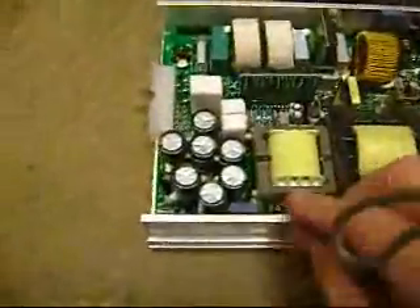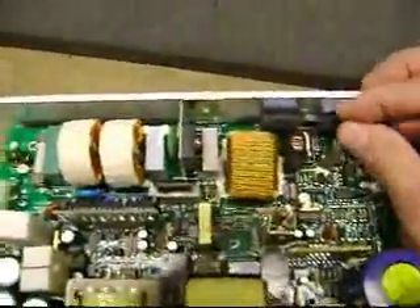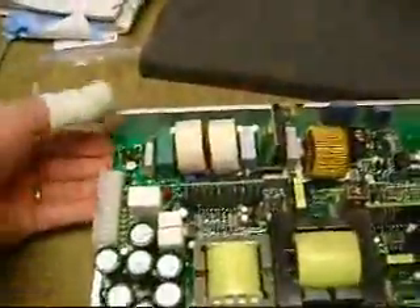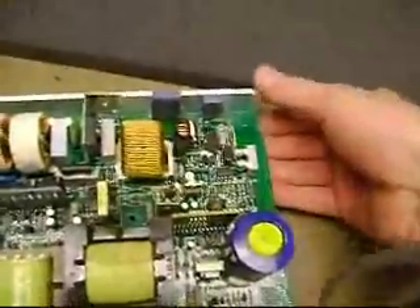With all the screws removed, make sure the semiconductors are popped loose from the heat sink — they'll have a tendency to stick a little bit. The entire power supply should slide back and forth. Now we have to pry it out — you do not slide it out, you actually tilt it out. You grab it with both hands underneath and tilt it up like this and the entire thing will lift out. Notice which side — there's a metal bracket here that connects the bridge rectifier to the heat sink. That's the side you pop out first and put down last.